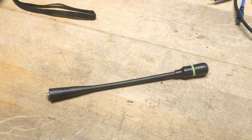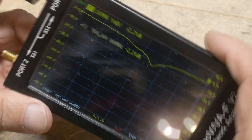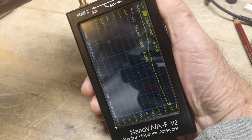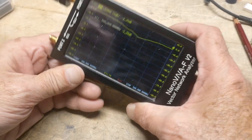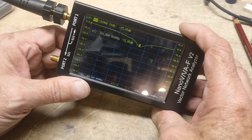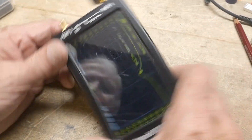So what frequency is the antenna really good for? Let's see if I transmit on the frequency that it wants. Let's get out the VNA. It's got a dip there, if I hold it different ways — I know this is terrible on camera, that's why I hate these nanos. If I just kind of let it do its thing, it sort of wants to be resonant about there. What frequency is that? Only 340 megahertz. Yeah, that's handy, isn't it? If I have any 340 megahertz radios — I guess this is a military radio. I don't get it.